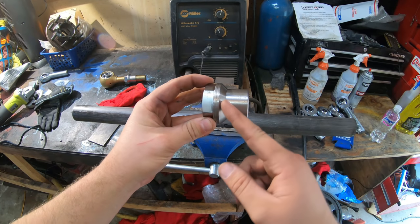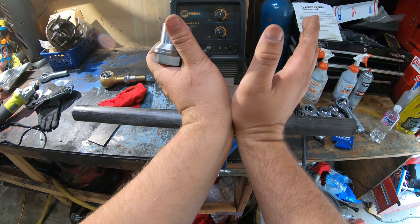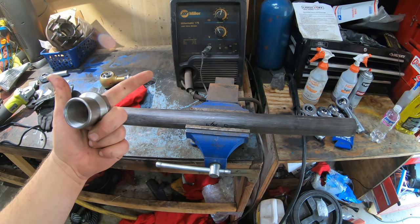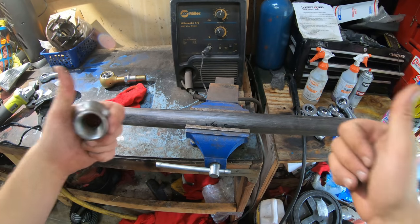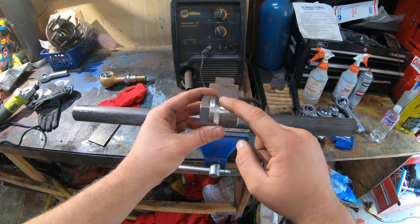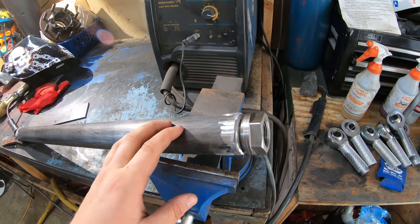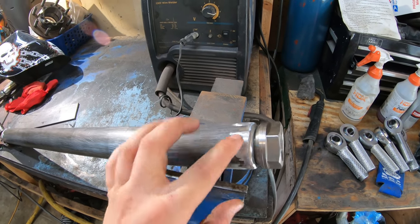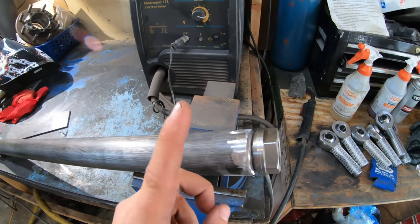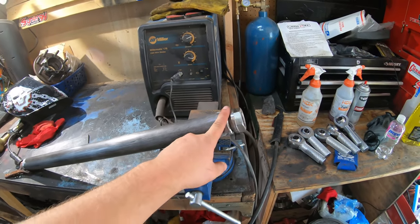It's time to weld the bungs on. The bung has a nice recess where we're going to weld. We're going to mimic that on the link itself so it has a concave on both sides for maximum weld penetration. We're going to bevel these edges so we can get a nice weld and make these links super strong so we don't worry about the welds failing at the bung. You can see it's slightly beveled — you don't have to go overboard, just a little. We clean up the metal, turn on the welder, do a few tack welds on each side, then weld it — we might make one or two passes.